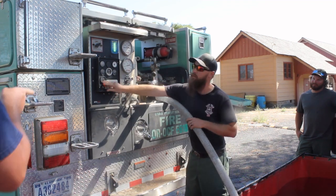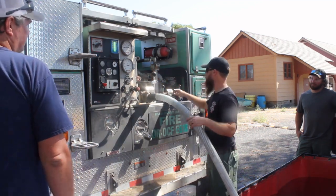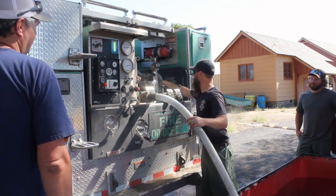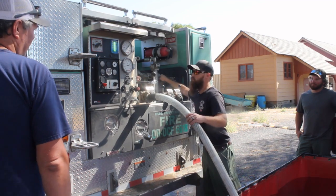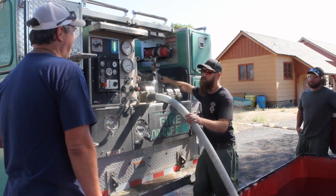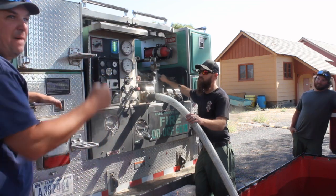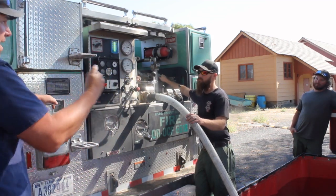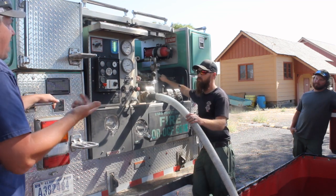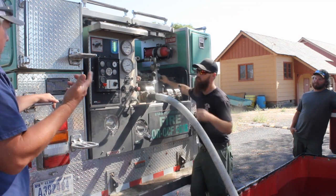You've got pressure on the gauge — let's send water, just turn water into the tank. That gauge: when you opened the number two, it went down to like zero and then came back up — that burst the air bubble out of the system. Now we're flowing water. Go ahead and give it about a hundred PSI. We got some RPM on the system.